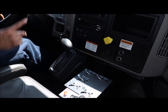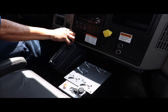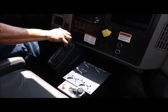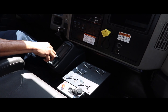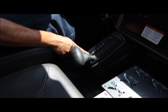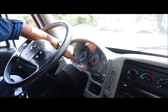If we want to go mobile, which we'll do in the next video, we're going to have to shift the transmission. You can do it while the PTO is running, there'll be no issue. I'll push on my brake, reverse, neutral, drive. I'm going to lower it all the way to first gear, and here we're going to make sure that the dial is showing number 1.